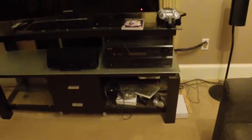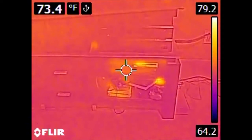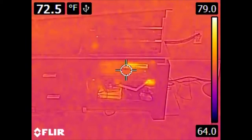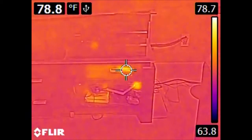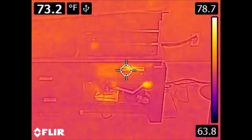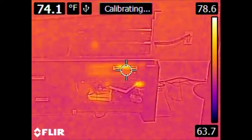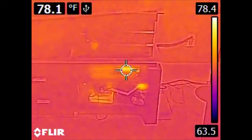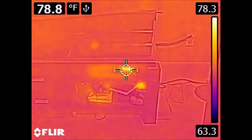We can also see a bit of heat coming off the PS3. The PS3 looks like it is sending off some heat from around this area, but this is actually reflected. The plastic is metalized to give it a chromy finish, and that metalized film is a radiant barrier — it reflects infrared. The infrared that it is seeing now is actually my infrared reflection in it.